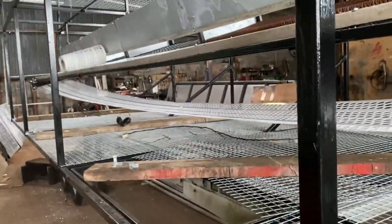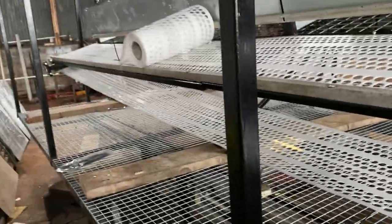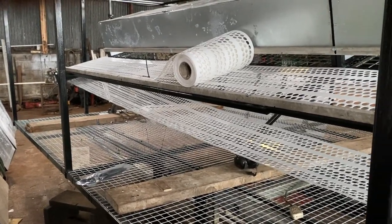What I need to do now is put in rollers for the return belt, and that's these here. It's basically because you don't want it sitting with this big lag on it. They're just a simple roller with spring-loaded clips in the end, and I just use little L brackets, like these. I've already drilled out some of these to take it. This is going to hold the return belt and take all that slack out of there, because I don't want birds jumping up in there and crapping in there. So I'm going to get these return belt rollers installed, and then cut off the belt and tighten it.